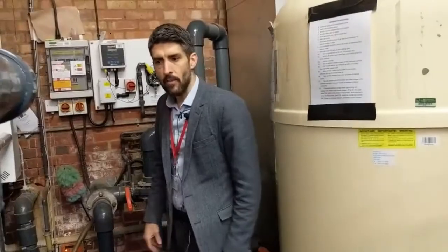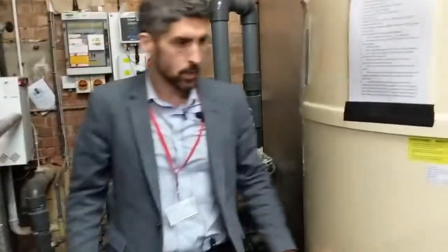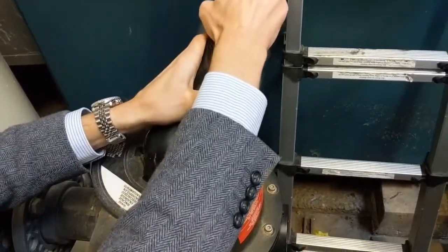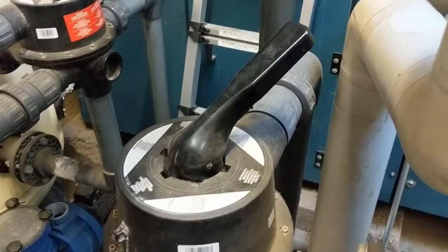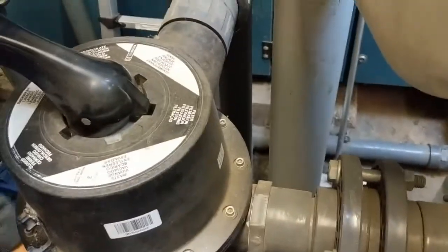The rinse has been going for about 60 seconds, so power off, and then go back to the filter. We want the filter going back to the normal filtration position, so again rotating it clockwise back to filtration. We're now getting the system back to normal, bringing filter number two back online since it's been closed off while we were backwashing just the one filter.